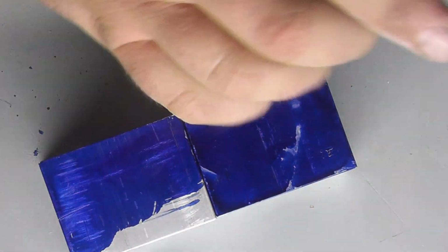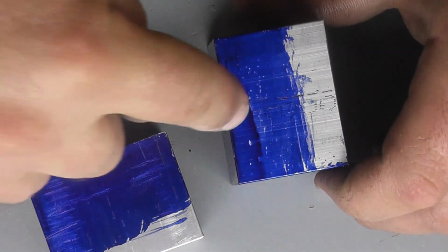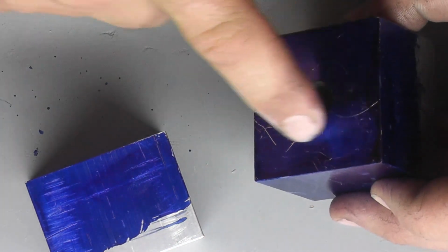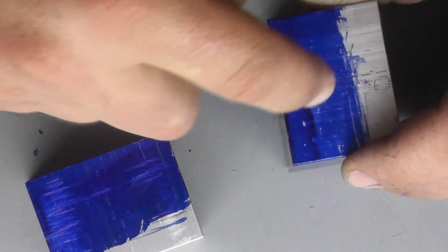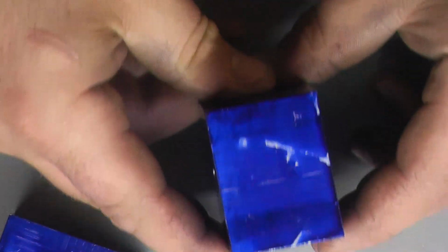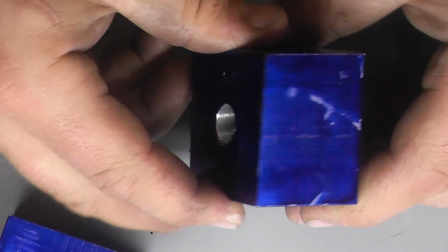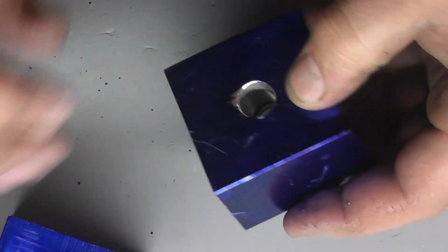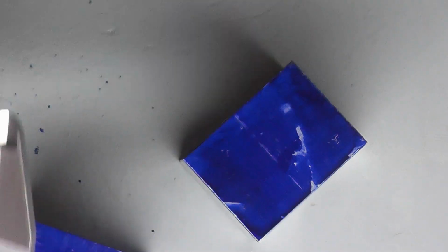And then on one block we'll have to drill a through hole straight through, missing the bore, so through this general vicinity here, straight through, and that is going to bolt up to our saw and become our pivot point for the cylinder. Alright, so now I'm just gonna lay all these out, and it's just gonna be caliper dimensions.